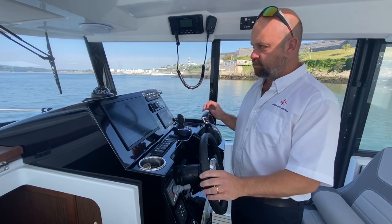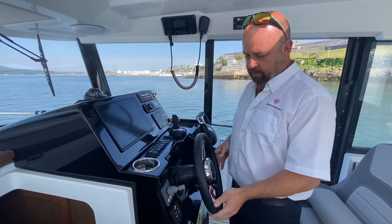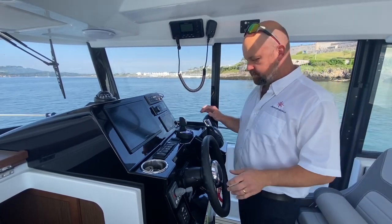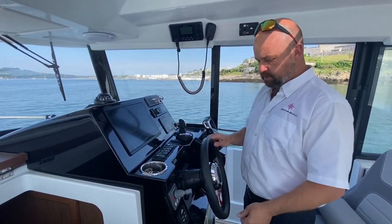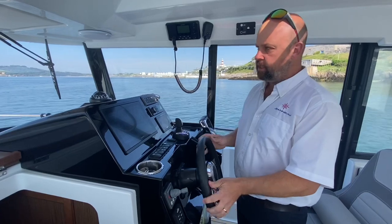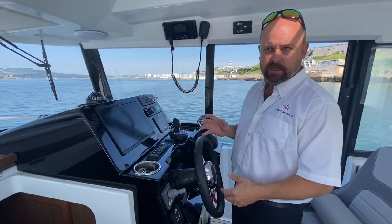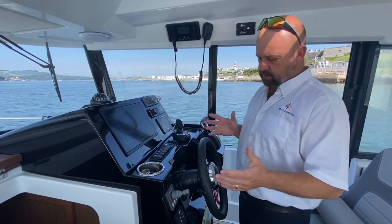So we've actually removed the hydraulic steering on this one and put on electric rams onto each engine, which I'll show you in a minute. So it's very, very responsive. And you can tighten this up as well, so you can make it give more friction to the steering, and you can have more turns or less turns in the steering wheel to adjust it,